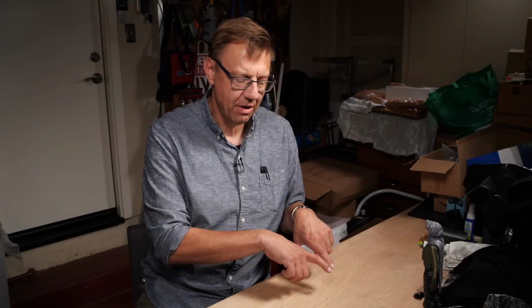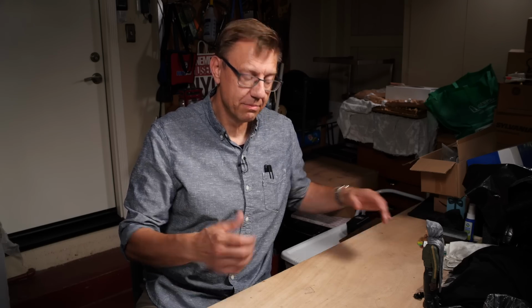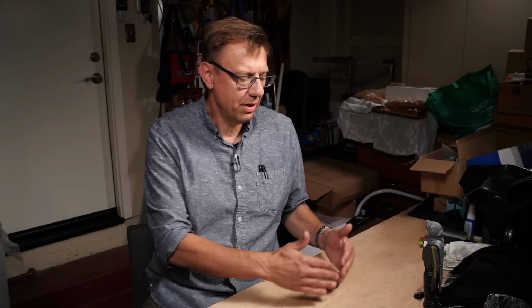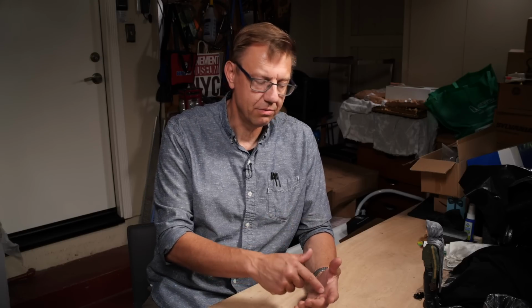So when I think about these LEDs, I think in terms of kits. You would have 4 of the 300 watt panels, stack them together, you got a 1200 watt light, 4x4. You could have 2 panels, you could have a Fresnel, you could have a par, and you could run them all off the same ballast. And now you've got an interview kit that is very low wattage, has pretty good output, and it's Kelvin tunable, and it's even frequency tunable for high speed if that's the thing.